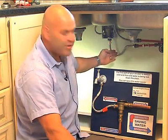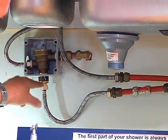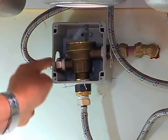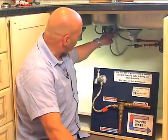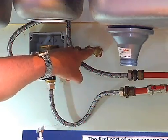The installation, as you can see, is very easy. That was the hot water pipe coming in. We just unscrew this flexi pipe from the tap, screw it on the bottom, put a new flexi pipe on the tap and screw it on the side. Then we put a copper pipe going out to a water catchment on the outside where we're going to catch all this red water.